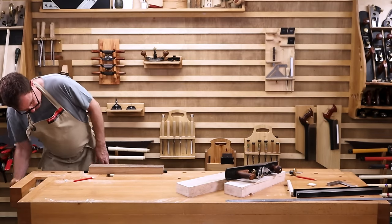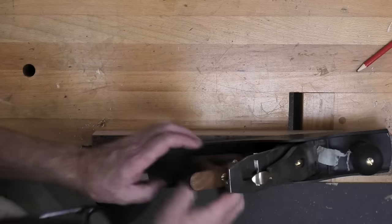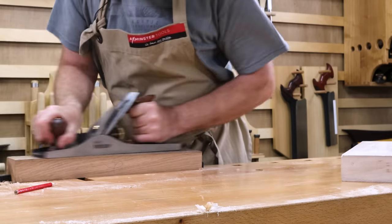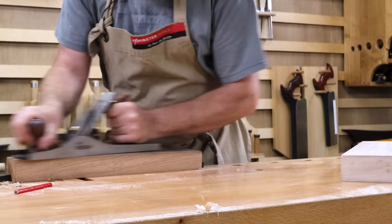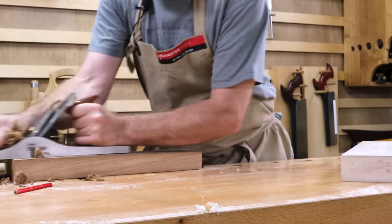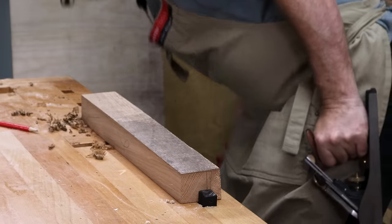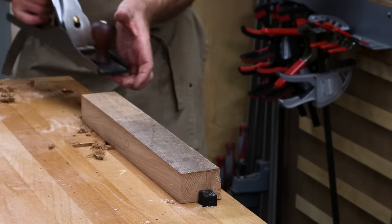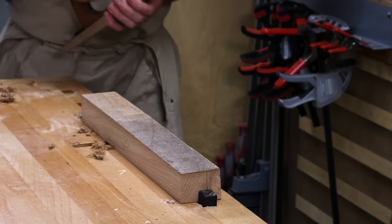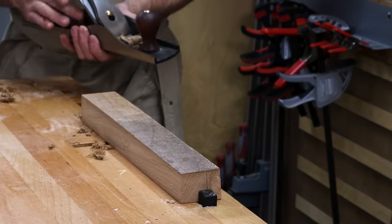Checking which way we're going. Bit of a pain really, because it'd be nicer to plane it the other way round. I mean, I could always get ambidextrous. Let's go the other way just to flatten off that corner a little bit. Now I know I've got a lot of material up there. Just knock off a little bit, good. Now let's go the correct way with our grain. That's given me something now just to sit on nicely so I can balance the plane. And we know this cut shouldn't go down too far at the moment. The minimum thinnest bit right on the bottom right hand corner.